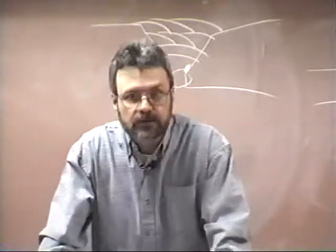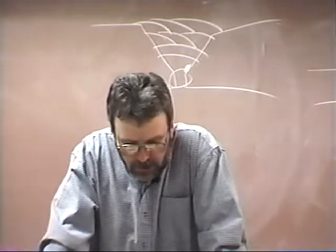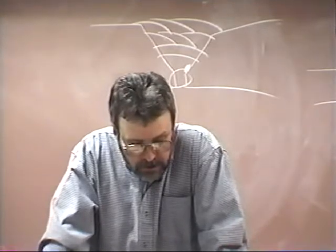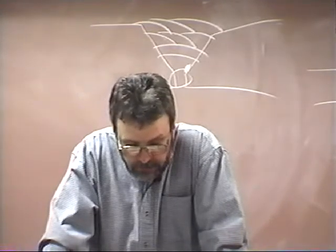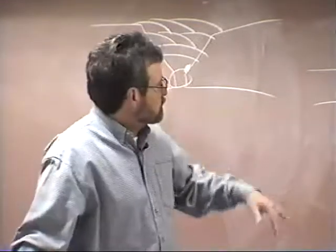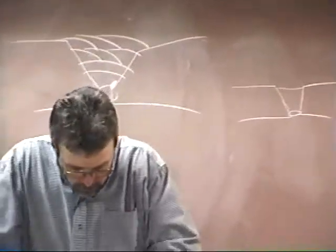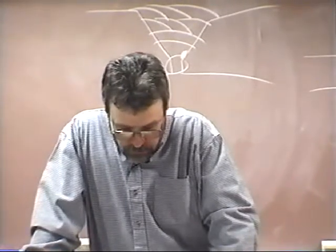Nice pictures of guys making welds. Let's flip to 132 and go to cover passes. Two questions, at least, coming off of this portion. When the pipe joint is filled almost to the surface, a pipe weld is ready to be capped using the downhill technique and stringer beads. The bevel edge should be visible on both sides to serve as a guide for depositing straight stringer beads side by side as the weld is completed. I discussed that before. You want to make sure that you leave the upper edge of that bevel to be your guide. When the first stringer bead has been completed using the bevel edge as a guide, the second stringer bead should use the inner edge of the first as its guide, etc.